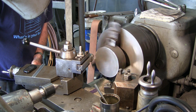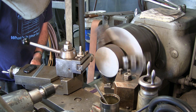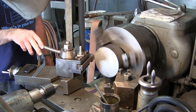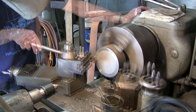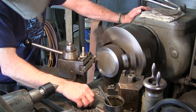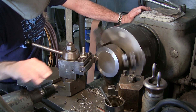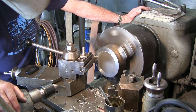I like to at least come in and take a cleanup cut. It looks like it's wobbling about 25, maybe a little bit more — there's 30. You can see that chip there — this is not ductile iron. I thought it was, based on the surface condition, but it probably was just a good-aged piece sitting on the shelf.